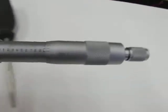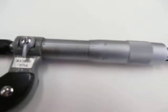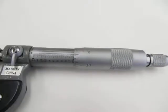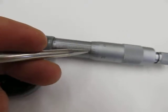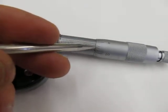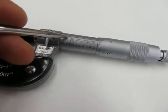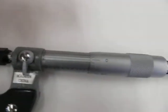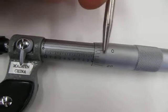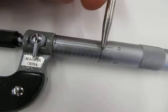When I hold it up and look at this one - here's the zero mark on the sleeve, the vertical zero mark, and here's the zero mark also on the sleeve. When I follow that across, those two line up. But the zero mark on the thimble is nowhere close to the other two zero marks down here.